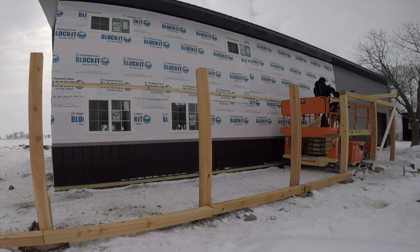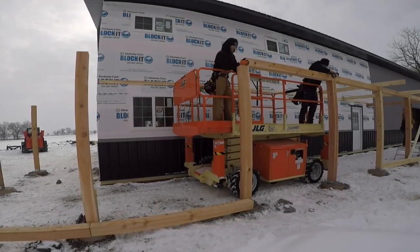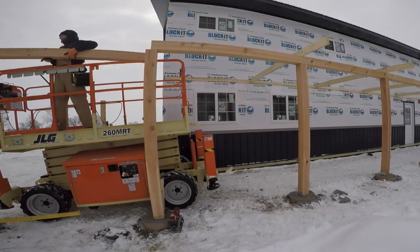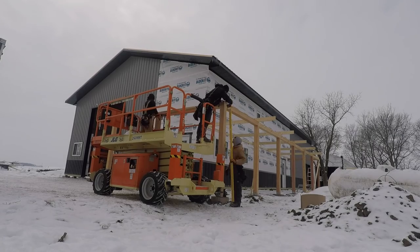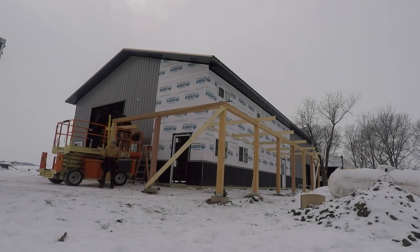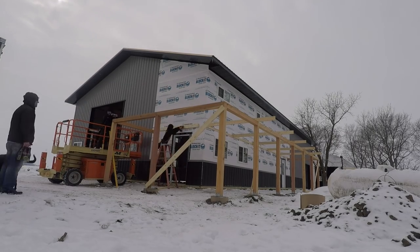Once we build the porch and everything is where we like it, we'll come back through and put some larger lag fasteners into the post. We've already pre-cut all of our header six-by-sixes — they're all eight foot on center, and at the corners we've got a little bit of a miter. For the most part we're just going to put some three-and-a-quarter-inch framing screws in on some toenails, then come back behind it with some eight-inch lag screws that'll go all the way through into the post. Those two-by-sixes sticking out are the bottom cord of our hand-framed rafters — they're also going to create our overhang.